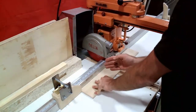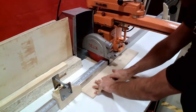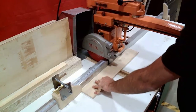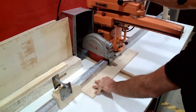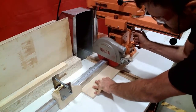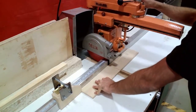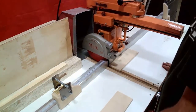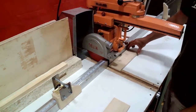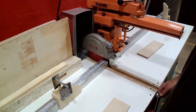I'm just leaning on that arm right now. I'm going to double-check — my hand is outside of 4 inches, so this is a safe position, and I can turn on the saw and make my cut. Again, I can pull my work piece away. This cutoff piece is big enough that I can grab it from this side and remove it from the table while maintaining the 4 inches of spacing.